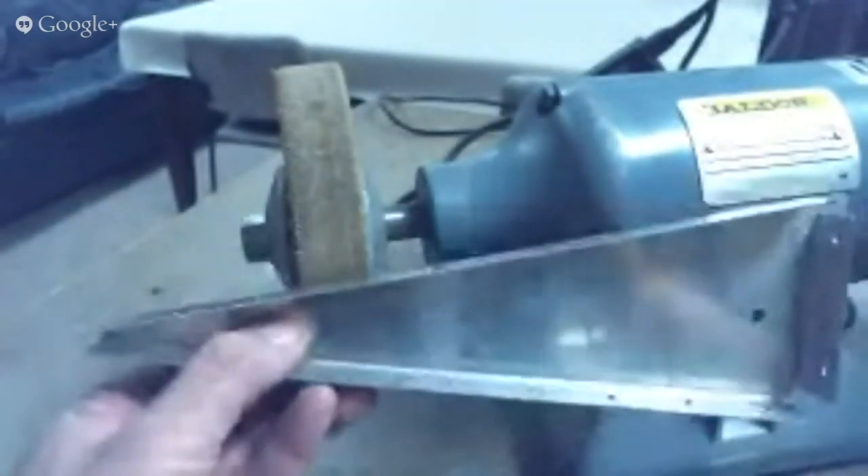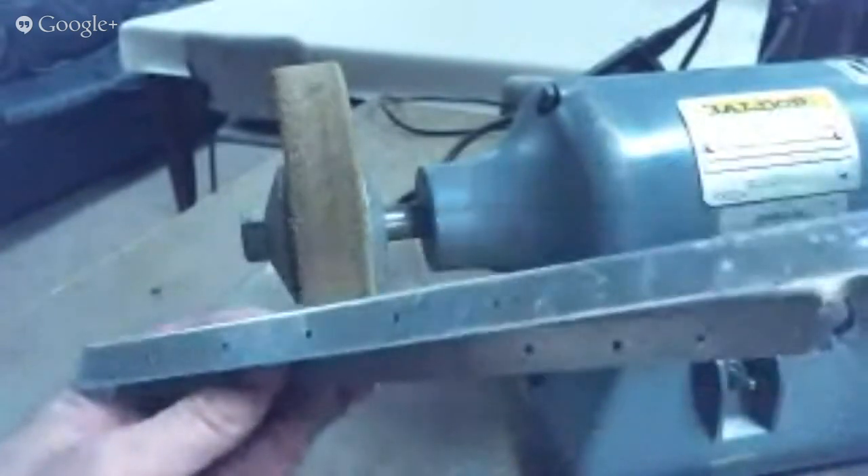Here are some beautiful holes — what do you do when you have a hole like this? That one you'd probably end up drilling out with an eighth-inch drill and using an oops rivet to fill the hole back up. You could count that as one in every eight bad ones, but yeah, that's pretty bad. This is actually a rib from one of the practice airfoil kits, so it must have been a student who was working on that.